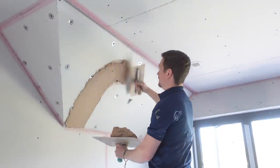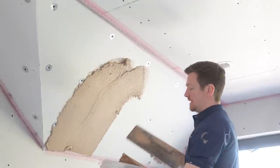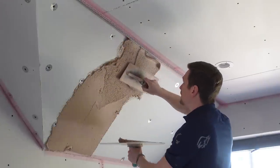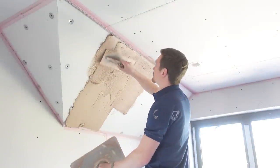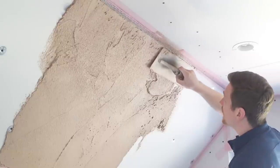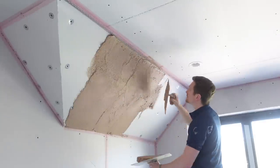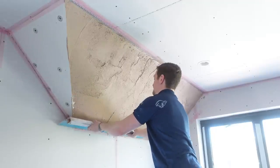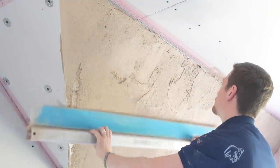The beads are on and we're just going to load it up now. The good thing about having the bead is we know how far we've got to come out. There is actually a massive dip in this detail here, so push it into the scrim and we know exactly how far to come out — squeezing it into that scrim tape because the bonding doesn't always like scrim and likes to fall off. Just carry on building it out, trying to meet that line where the stop bead is, so when we add the finish we haven't got too much to build on. Rule it off — don't want to take too much off as it's still quite thick.